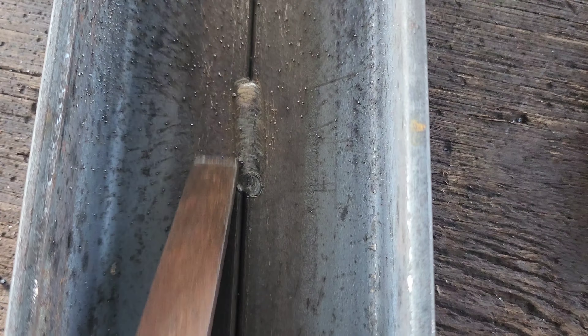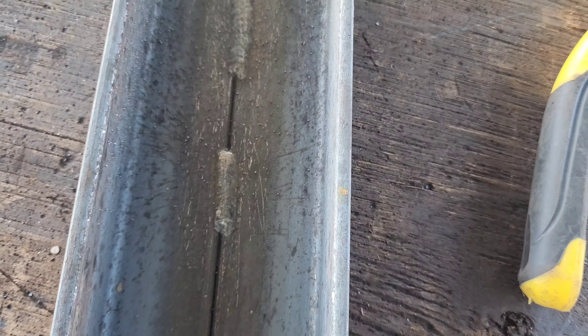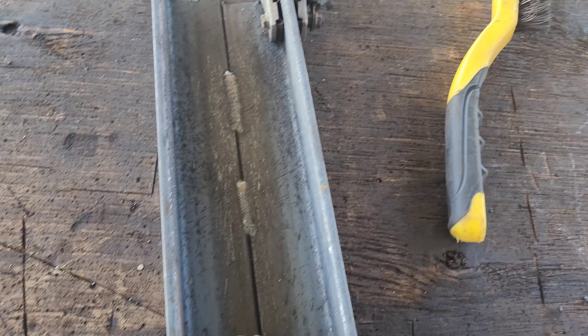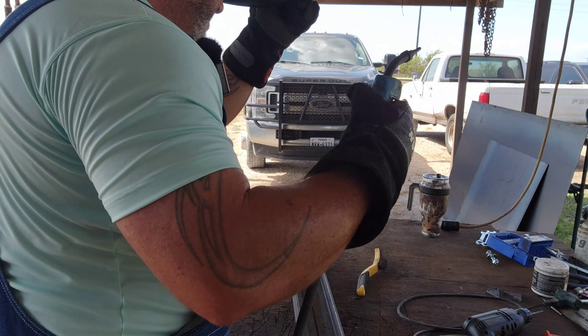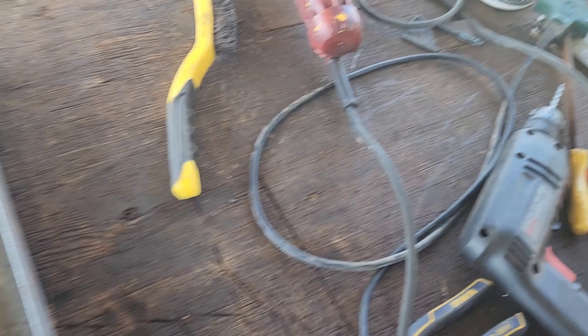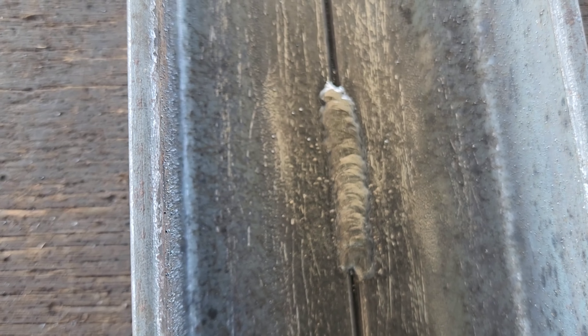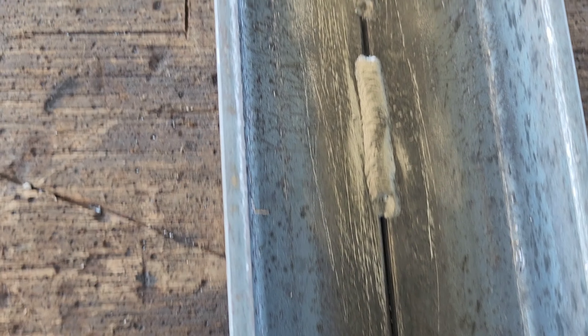These two pieces weren't prepped — they were just stuck together. I didn't bevel the sides, didn't really prep anything — just put them together to show you. That was 75, now let me do one on 80 to see what 80 does. You can tell a bigger difference using the wire wheel versus just a wire brush — obviously the wire wheel is going to be better. There's your 75, there's your 70, and there's your 80. Obviously your 80 looks a little bit better. This is quarter inch steel, so I don't usually use 80 — I'm usually welding on one eighth — and at that thickness your 75 or 80 look even better.